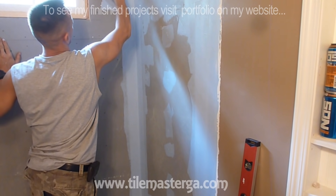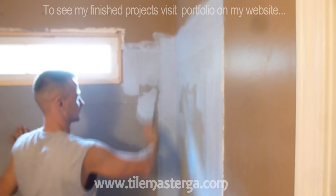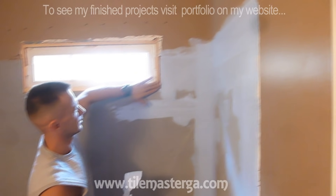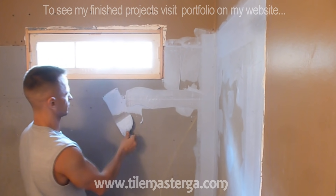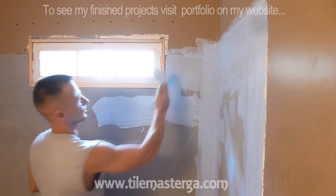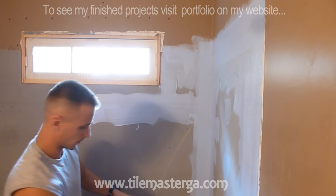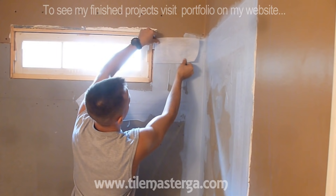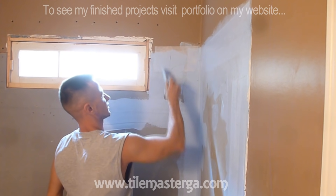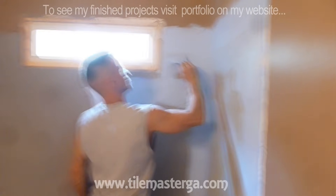In this particular project, we have a window — it's a slightly different scenario when it comes to waterproofing a window. I'm going to apply the membrane just a little bit so it overlaps on top of the wood over here. I still have to prepare the top part, so I won't show working around the full window, but I'll show how it's done on the bottom section. The top part is pretty much the same situation. This tape waterproofs and also reinforces the wall.